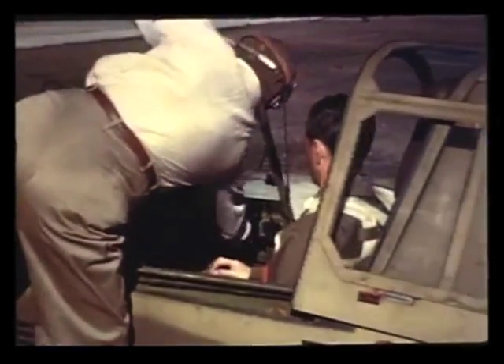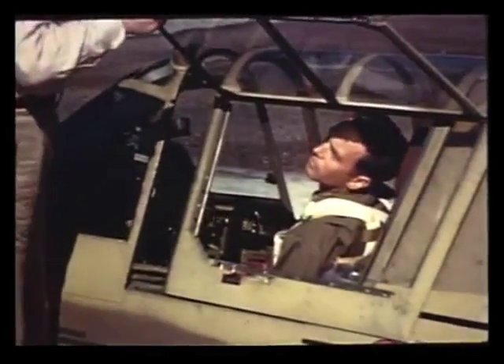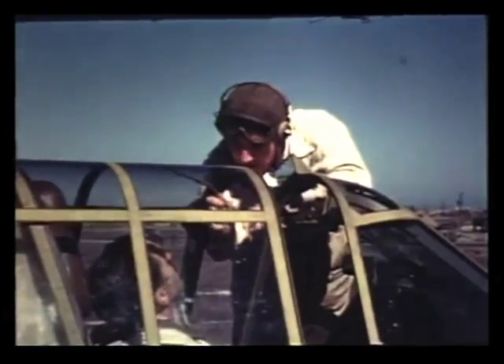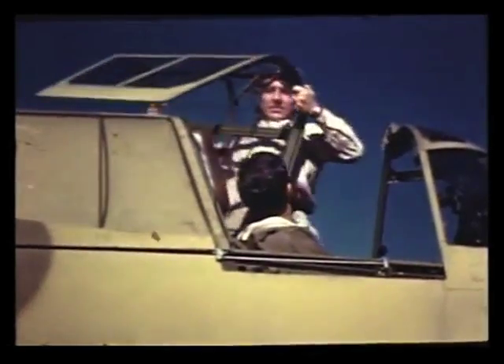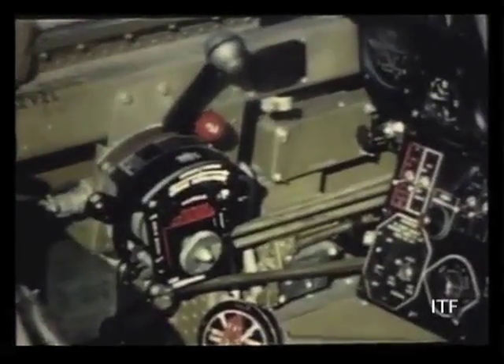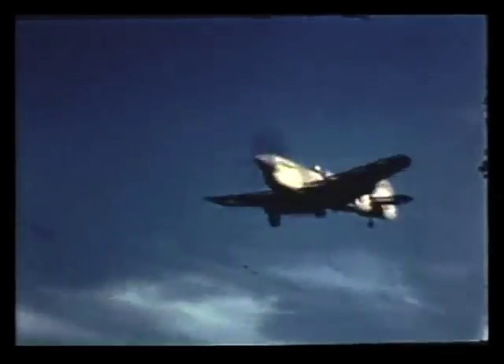If you ever end up with the airplane on its back and the cabin closed, you can open the kick-out panel in the left-hand side of the sliding hood by means of this red lever. There's another emergency exit you can use during flight — up on the top of the cabin roof is a red lever. Simply pull this lever and it will release the whole cabin. Getting back to landing procedure: check to make sure the mixture control is on auto-rich and the propeller governor control at 2,650 automatic setting. Have the propeller set this way for plenty of RPM in case you have to give it a gun and go around again, but not set for a full 3,000 RPM because it might momentarily over-rev if you open the throttle too fast.